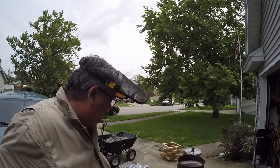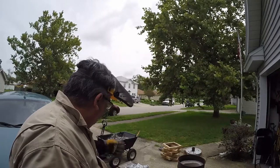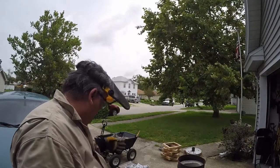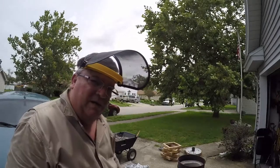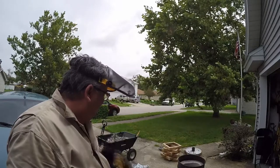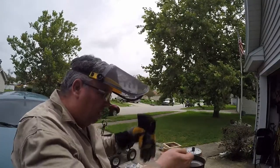Okay, so I've got some cleaning up to do, and in the near future, after those get cooled down, I'll go ahead and cut them off, take the excess metal off, and start planning for my next heat, which is going to be one more of those, at least. I'm also thinking about making some alignment pins for those. It worked out good. Everything poured fine, just ran out of metal. But if you have alignment pins with those, there's less of a chance of things getting jostled a little bit.